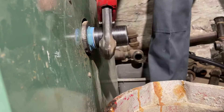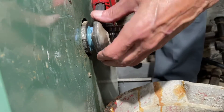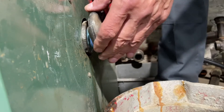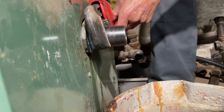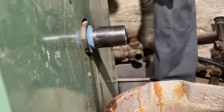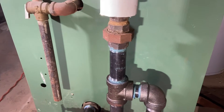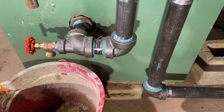After I got it as snug as I could with my channel-lock pliers, I went and got the 18-inch offset wrench to finish it off and get it in there tightly. On the opposite thread I used thread lampwick with Blue Monster tape followed by Blue Block. For the rest of the joints putting everything back together, I used Blue Monster tape along with Blue Block. As you can see, I put it all back together — I reused the two unions, which were fine and came apart well — and put a new three-quarter-inch drain valve in there.